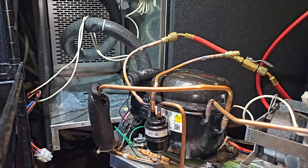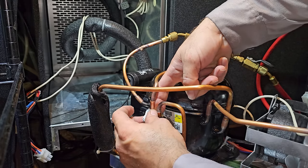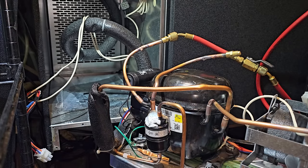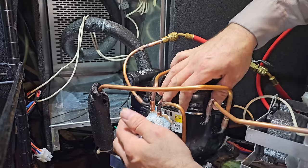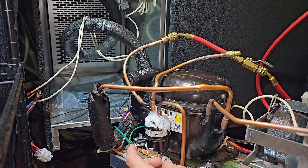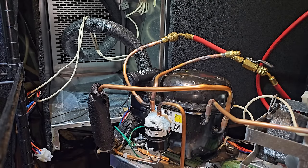It's gonna be silly. There's times when this heat blocking compound is just too, the dryers can be too small, you know? There's not a whole lot you can do right here. Want to make sure you don't get it into the brazing area. It's gonna burn no matter what. It's inevitable. I guess we're just reducing the amount of burning. Again, I'm not gonna fault this stuff for not protecting this. A lot of times people ask me why I don't protect things this small. It's because it's dang near impossible. Extended connections on dryers should be a must all the time. Short ones, especially on these little guys, just plain stupid.